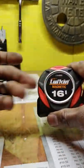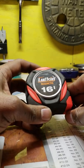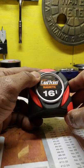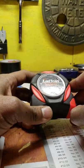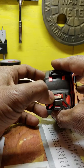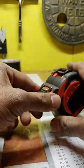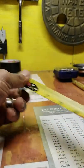A tape measure is something a lot of new guys don't have when they first get to my shop. They're thinking calipers and micrometers — and you do need those — but a good tape measure is really handy for when you're in a stock room and you have to cut your own stock. Getting one that has a magnet on the tip is also very handy, especially if you have a really long piece and you need to stick it to the end and measure accurately.